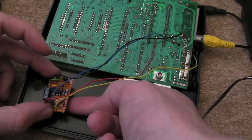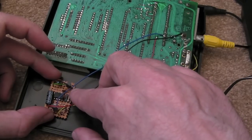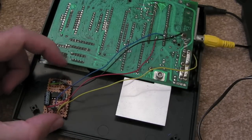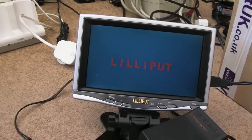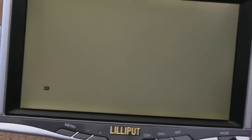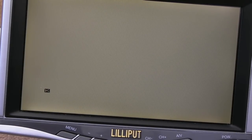I've got a special double-sided pad with an aluminium grip - you can bend it down and it'll grip the PCB and stop it moving. I'll use those two things in combination: double-side tape it down, then use the aluminium grip to hold it. We'll give this its first test now. You've seen the before where it was really washed out and almost looked inverse. Let's plug that in. Look at the difference - that's phenomenal! I'm amazed that's worked first time - I was half expecting to have missed something off the diagram. That's fantastic.